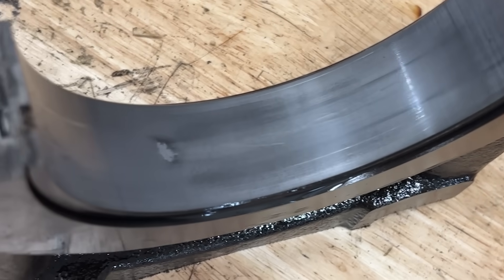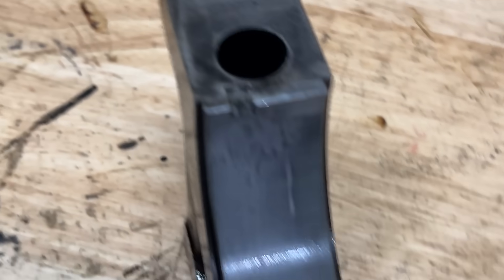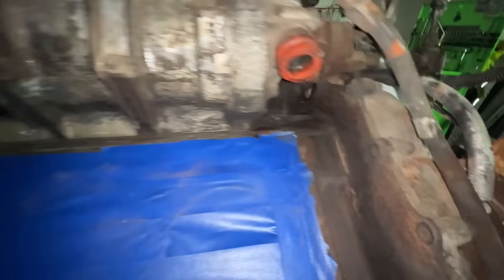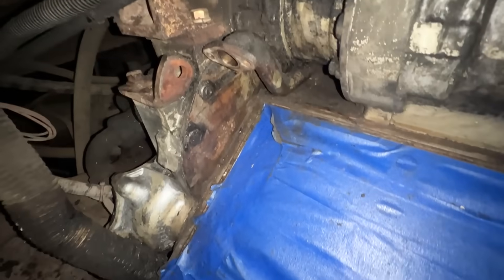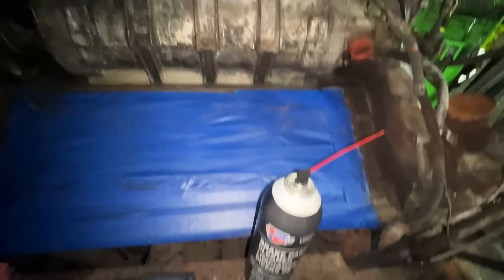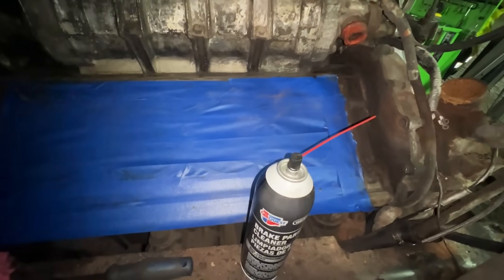Just very light wear — it's honestly one of the best main bearings I've ever taken off a 92 series. I'm shocked by that. Obviously it needs to be replaced, but considering it had all that water going through it. We started cleaning everything in here — this was all just caked with grease and dirt. We still have a lot to go. We've got to have everything cleaned really well when the heads go back on — probably six to eight hours of cleaning before everything's done.